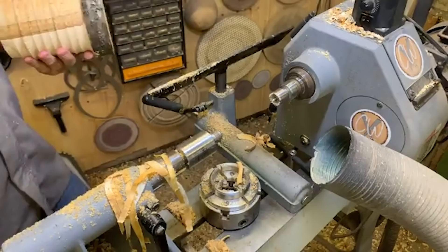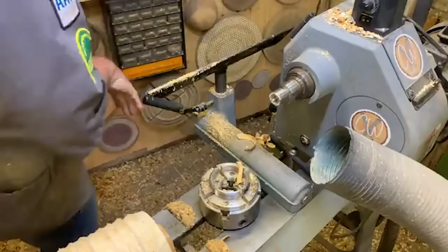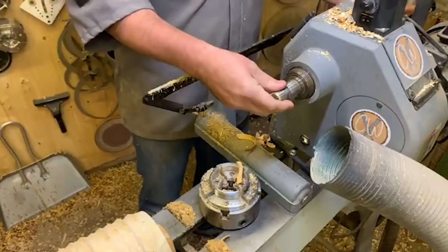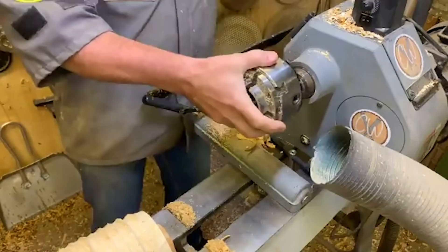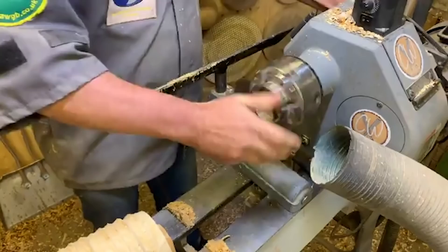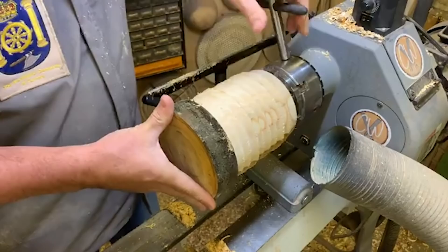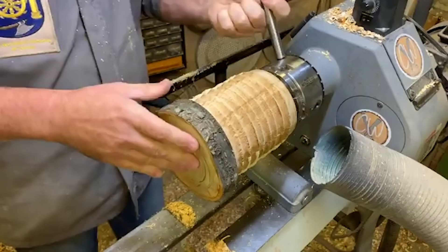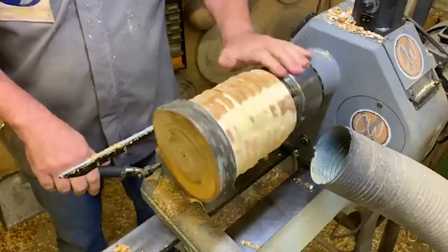Question: are you turning wet or dry timber? My preference is wet timber, but I don't do it very often - I'll do it for rough turning. You've seen all the rough-turned bowls around my workshop. Necessity says most of the turning I'm doing is going to be dry. Preference is wet because of the way it forms and the way it cuts, as you can see. I'm not overly keen with the mess it leaves behind though, because if you don't pay attention everything will rust up - especially timbers like oak, yew and olive that have got that heavy tannic acid content.